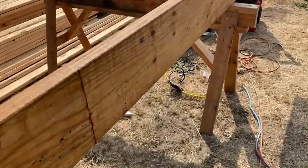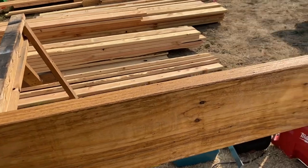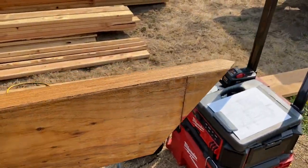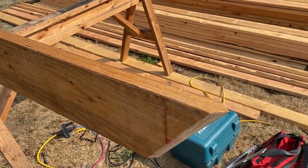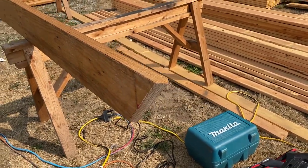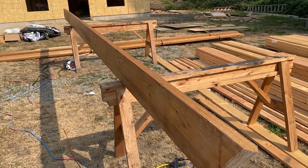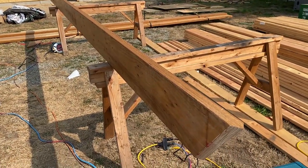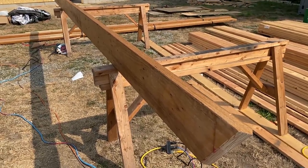Okay, so now I'm going to lay this out. That's a little trick I like to do to make sure I'm accurate. I wrote software to do this on a normal roof, but I'm pulling everything from a center common and working out from the middle, so it's a little different than what I have programmed. I had to do this one custom last night, so we're going to see if it works.